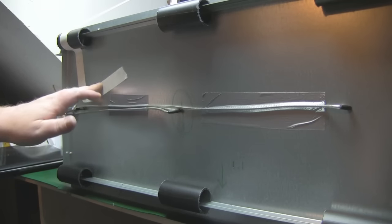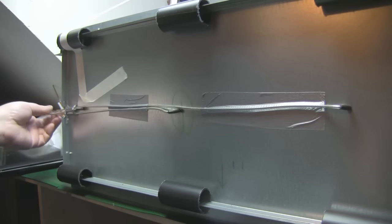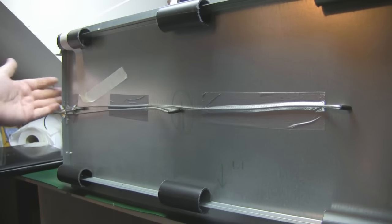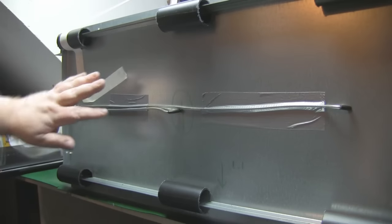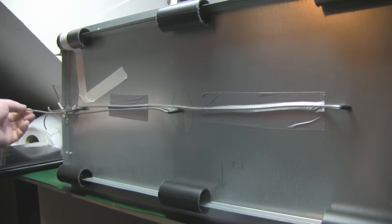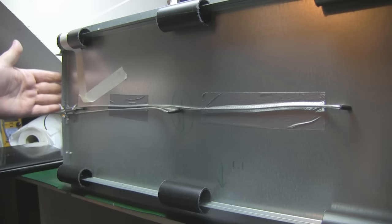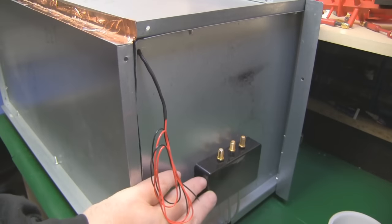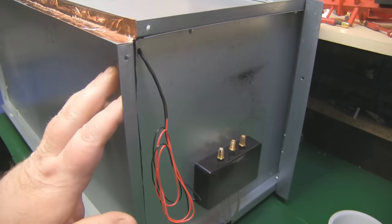It's just temporarily held with duct tape; I've got it coming out on this side where I'm going to be connecting it to the spectrum analyzer or network analyzer, since I have my test equipment off to the side. What I'm going to do now is put some bulkhead SMA connectors on a little temporary panel on the side here so we can connect directly to them. This is how I've attached the inputs for the coaxial cable so we can get some data out of this anechoic chamber.